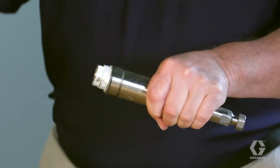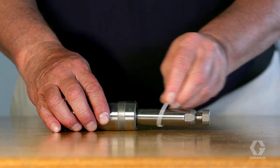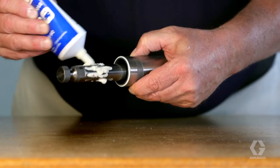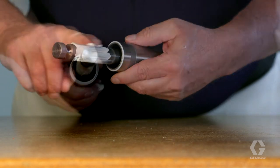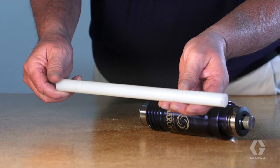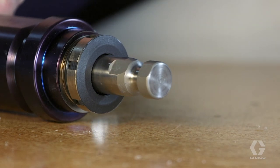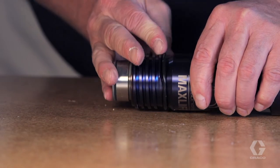Slide the sleeve over the piston using a plastic hammer to ensure the rod is completely installed. Approximately center the packings in the sleeve. Position a new white O-ring onto the sleeve, making sure it rests flat. Liberally grease the piston rod. Slide the sleeve and piston rod assembly into the bottom of the cylinder and ensure at least two inches of the piston rod sticks out through the packing nut. Replace the outside O-ring onto the cylinder.